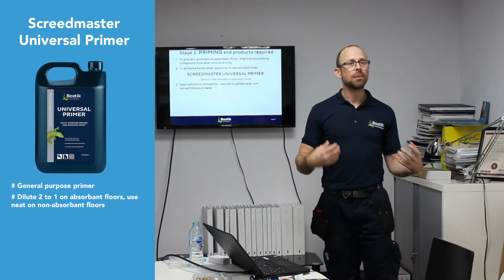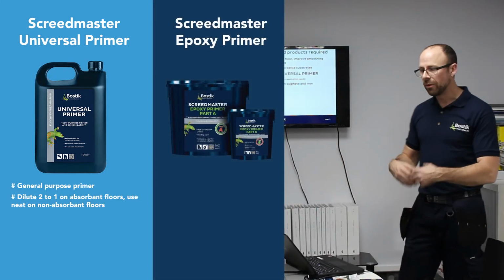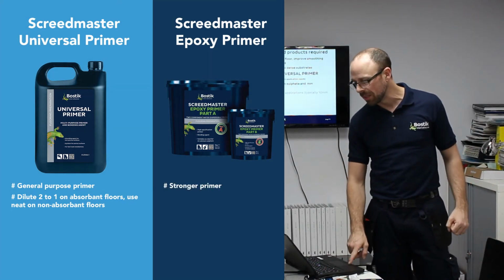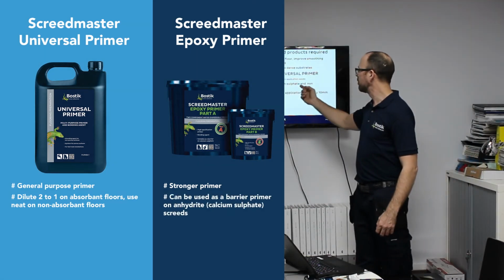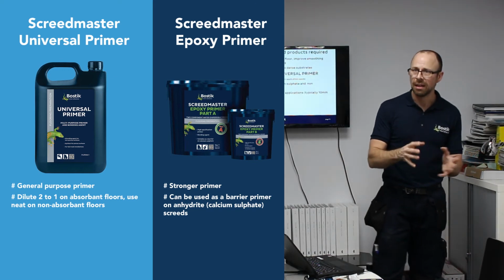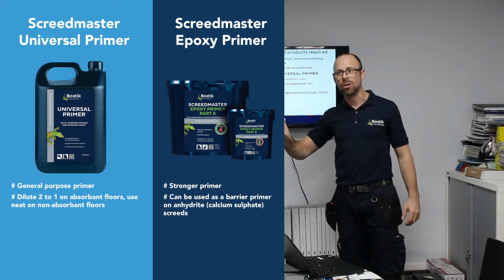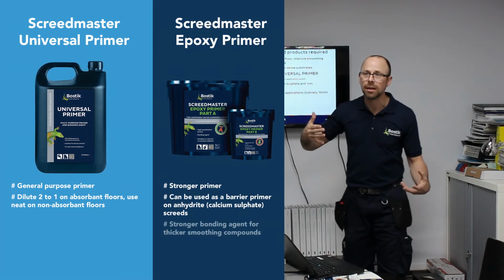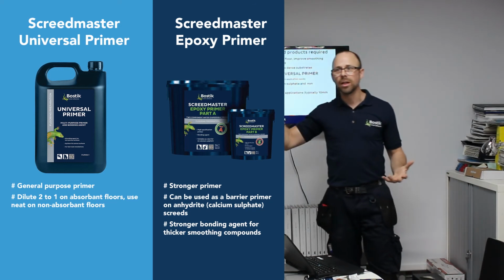Sometimes there are different types of screeds out there, or you need to apply your smoothing compounds at different thicknesses. So we've got a bit stronger, much meatier primer out there called the epoxy primer. And that can go over things like anhydrite, calcium sulfate screeds. They're a bit of a bugger that you'll come across in the building market. People don't like them. If you've got a job where you've got to build the levels up in the floor over 10 mil, then you want to go for the epoxy primer, because the epoxy primer is a stronger bonding agent, which means you can go thicker with your smoothing compound.